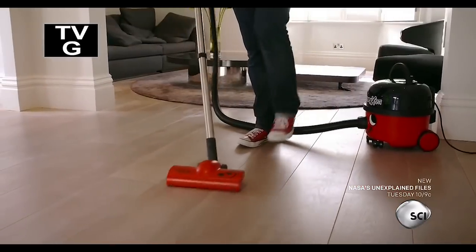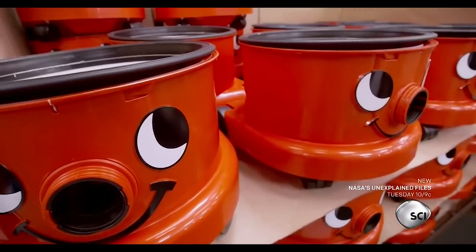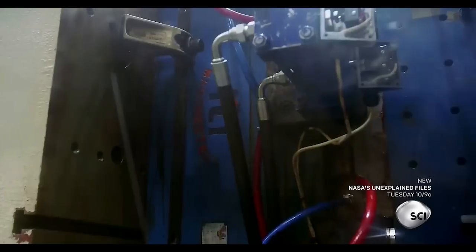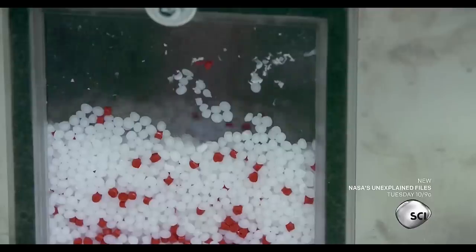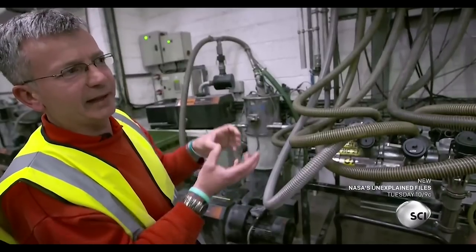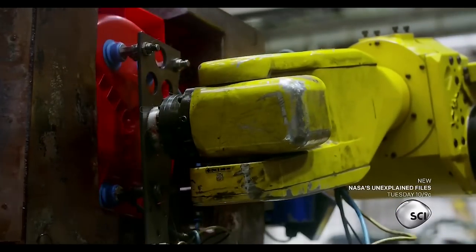A vacuum cleaner needs an airtight drum to suck up dust. The secret is to make a plastic mold with a leak free seal, so Ian uses injection molding machines to create an airtight body with ferocious suction. Sensors call in the correct volume of beads which the mold melts and squeezes together — they get fed in, and when they reach the injection unit they are turned into molten plastic under high temperatures, about 180 to 220 degrees.